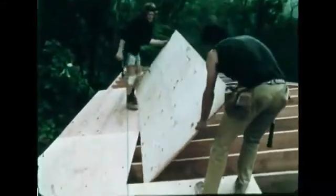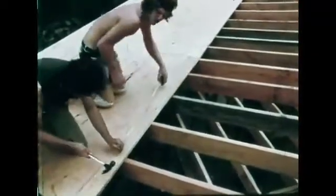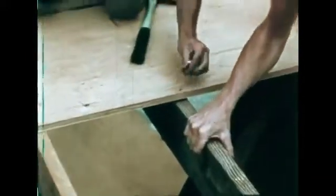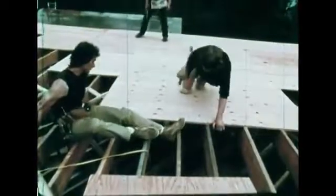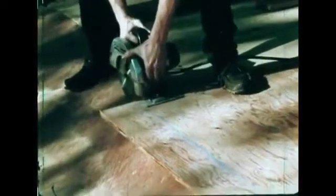While the top and bottom ends of a rafter might be in the correct position, the middle may be off due to bows or curves in the wood. Marking the rafter spacing on each course of plywood enables the carpenters to keep the rafters straight as they work their way up the roof. A chalk line marks the plywood for the last course.